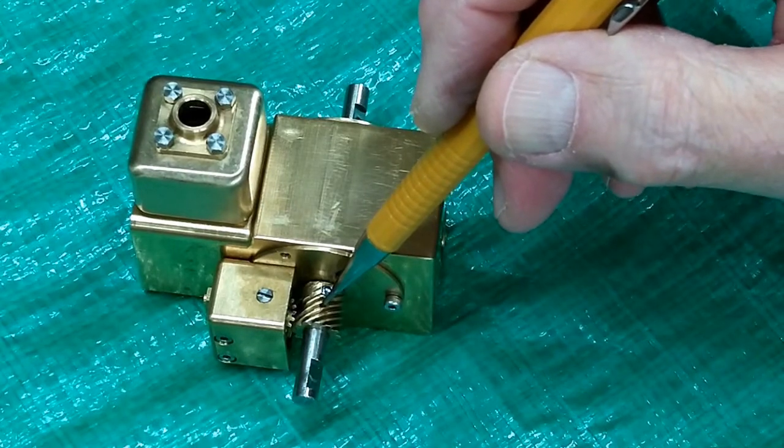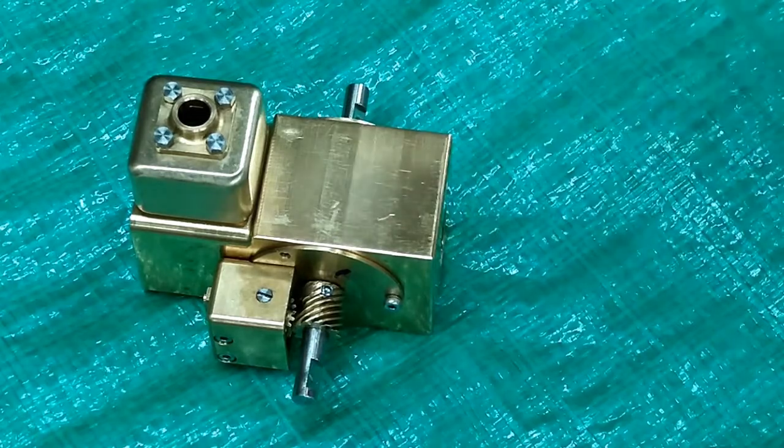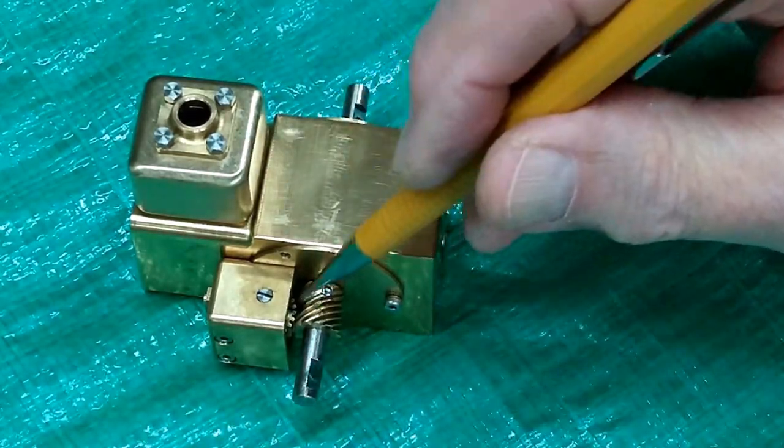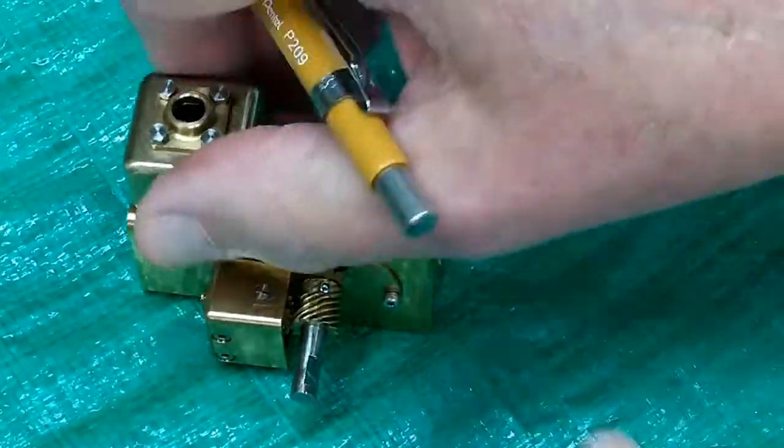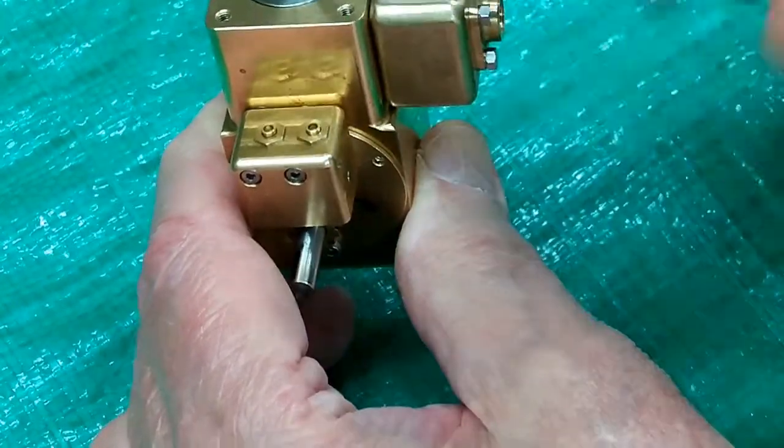This gear has 12 teeth on it, and the gear with the cams has 24. When you're timing that, if you don't know where you're at, your only reference is to turn it until those followers are right in the middle — both of them a little bit up.